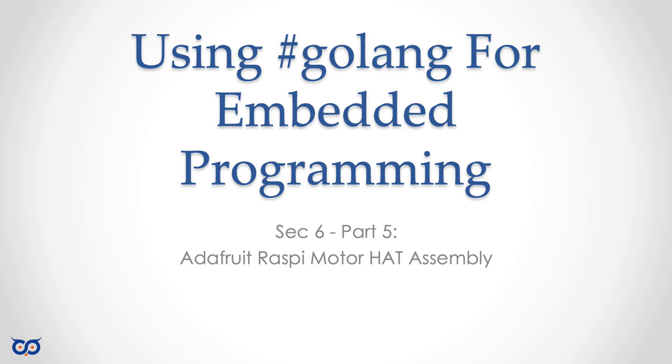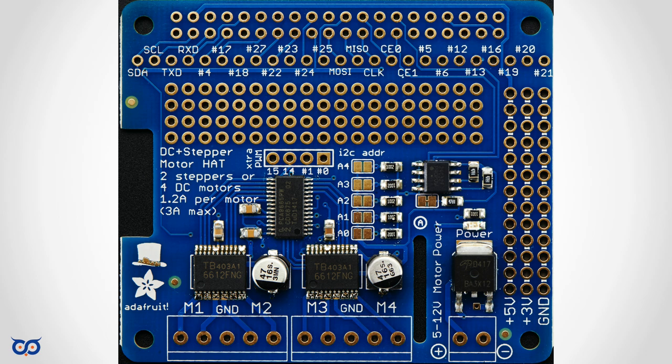I switched to a Raspberry Pi, and I've been thinking that the Raspberry Pi has enough power and everything to allow me to do exactly what I want. The first motor controller we tried with it is this SB Components shield. And now I'm going to try this Adafruit motor HAT, which is an I2C board. Basically it means that instead of using GPIO, it uses this I2C bus, which is basically just 2 wires, minus ground and power. So it's a lot fewer wires to control. You're only using 2 wires for signaling, a data pin and a clock pin, because ground and power is always there.